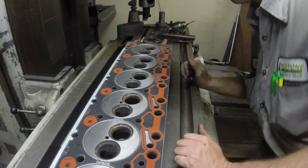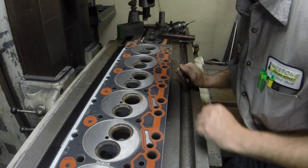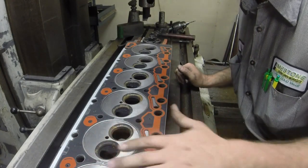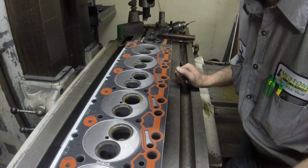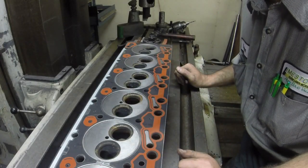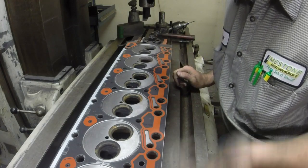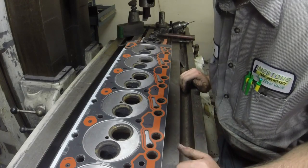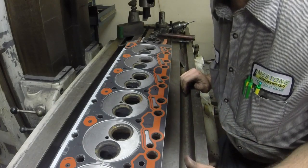Okay guys, so there it is — this job's done. The fire rings are all sitting in their grooves in the gasket, and I've checked the protrusion on all of them in four different places and everything's good. We're within less than a thou over this whole head — that's where I'd like to be, somewhere around a half a thou. Total error is less than a thousandth — that's about as good as I can get it, decent tolerance over 36 inches here on this old mill. Thanks for watching and thanks for subscribing. Hope you enjoyed this high performance part and maybe learned a little bit — see you later.